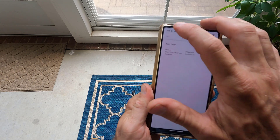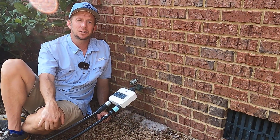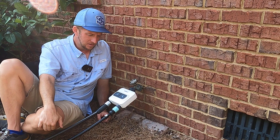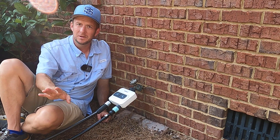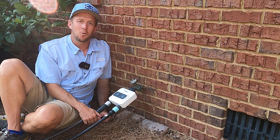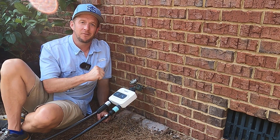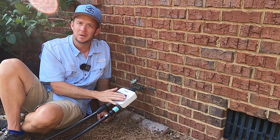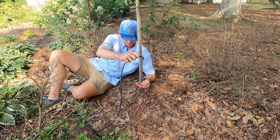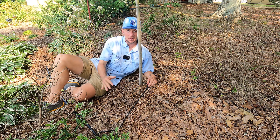I'm going to manually turn on the drip and go up to where the drip is run to make sure it's running. I hear the water going through — sounds nice and smooth. I don't hear any water hammer in this, which is nice. Sometimes with valve assemblies you'll get what's called a water hammer with excessive or insufficient water pressure, or a lot of turning within the valve itself. The water sounds nice and smooth going through this valve. It's working like a charm — this is going to take hours out of my monthly routine of coming out here and hand watering.